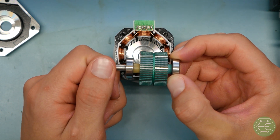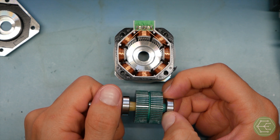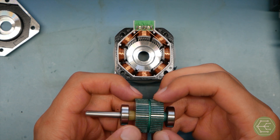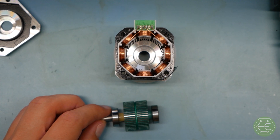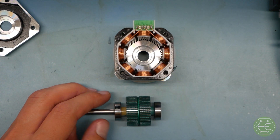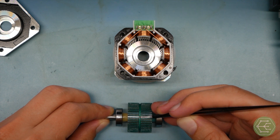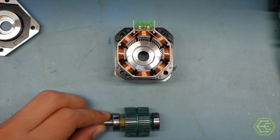These teeth are critical to the functioning of a stepper motor — these are the teeth that define the 1.8 degree angle. It's one magnet in the middle with two end caps, and you can see that they're offset. These are magnetized — if I put my tweezers in and run forward I hit the other one, because one is the north pole and one is the south.